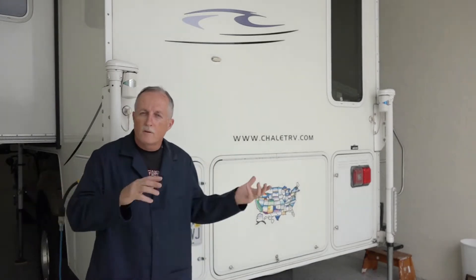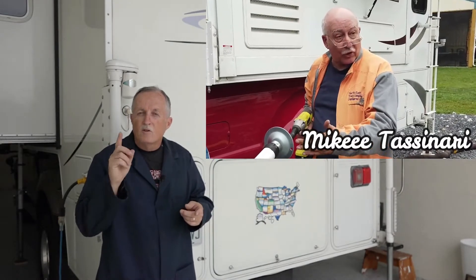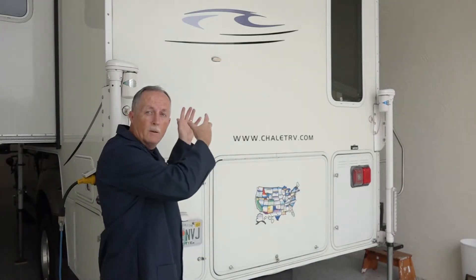Charlie Cushain here. As some of you may be aware, I have this beautiful 2012, now eight-year-old truck camper that I've had an issue with the heating system. When you turn it on with propane, it would run for about 20 minutes and shut off, then come on 20 minutes later and go off again. I thought that was by design so it wouldn't wear out my batteries on a cold night. But it turns out, after talking to my good friend Mike Tassaneri, an HVAC specialist, my furnace was getting starved for return air. The furnace would blow into the cabin and the air couldn't get back to the furnace, so it would heat up and shut down.